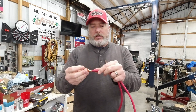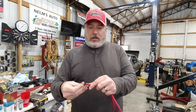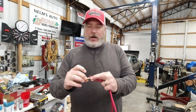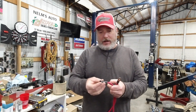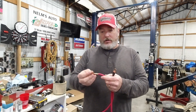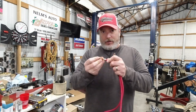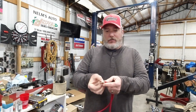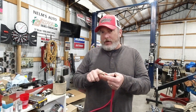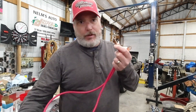Basically I'll see how much I need to cut off - I want to fill the lug up but I don't want it to be unshrouded, I want this to be totally covered so I can heat shrink it, so really you want it to about right there. Some of those wires will push up into the tapered area. As I cut it, go ahead and slide your heat shrink tube down because you might not be able to get it over there once you get your connector on. Trim your insulation back on your wiring and slide it in the connector.